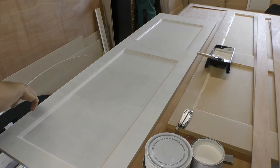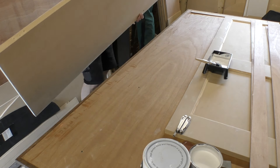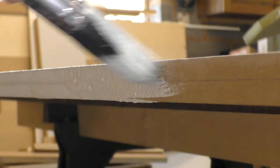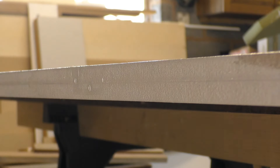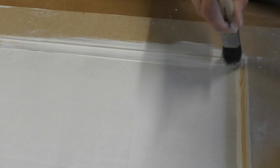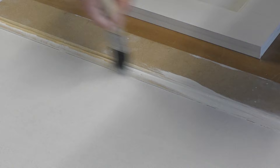The other thing I like about the shellac is it's so quick drying — I've literally only just finished painting this and I can handle it already. Just working with this stuff today I'm a massive convert. When I did my comparison video I sort of saw the thin consistency of the Zinsser as a bit of a negative point, but actually it's what makes this stuff so good, because particularly as a primer it's just so easy to paint on.